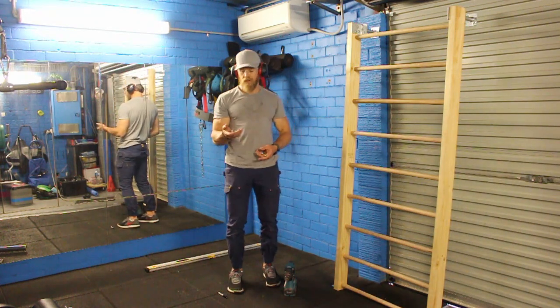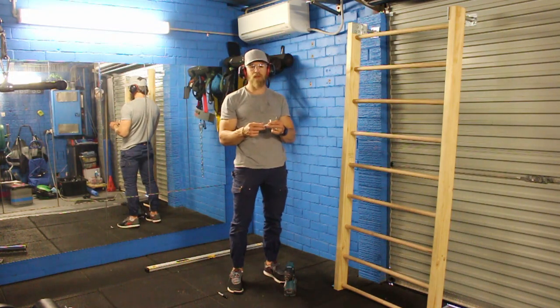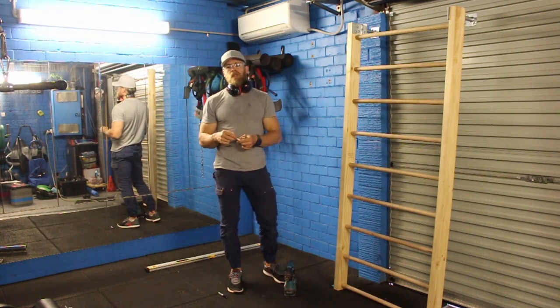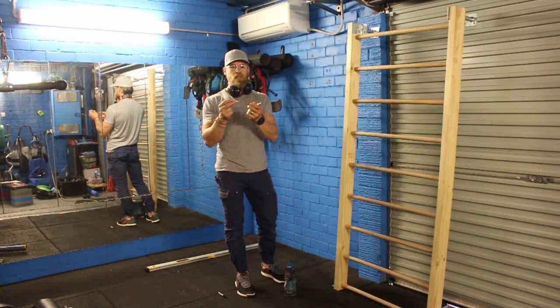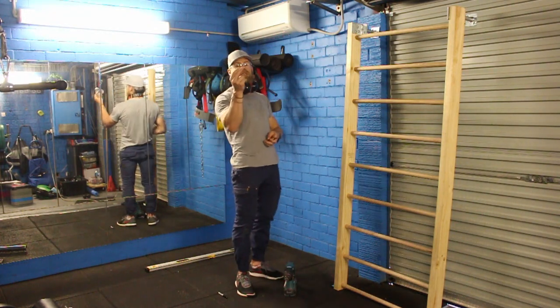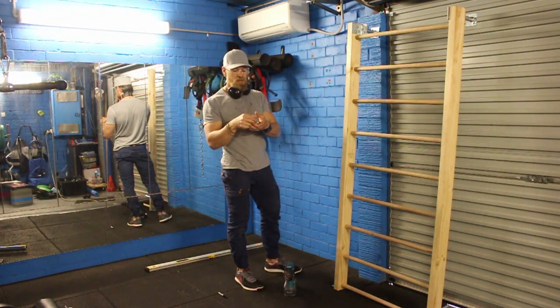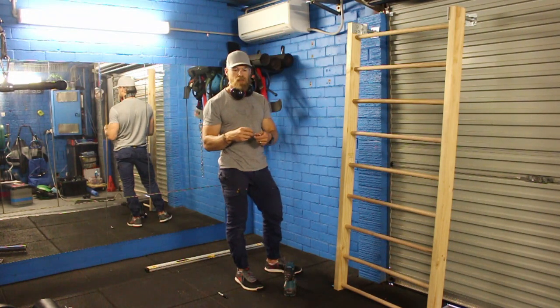Okay, just quickly, when selecting your masonry bolts or your wall anchors, they do come in different ratings in terms of strengths. These ones hold up to 360 kilos. The other ones that were at the hardware store only went up to 60 kilos. So just be aware of that when you're buying them. So these ones are only 50 mil, so I don't blow out the back side of my bricks. And there's two in each bracket, so you know, 360 kilos each, they're plenty strong enough.